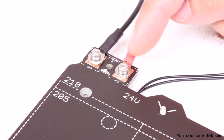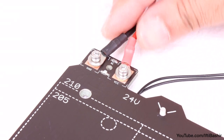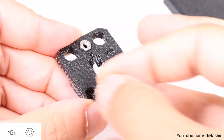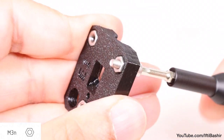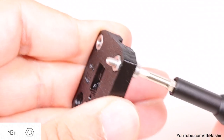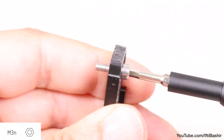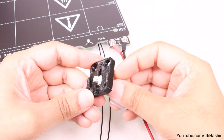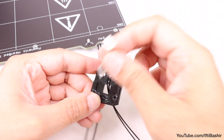The cable cover, which we'll install next, needs the connectors to be slightly inclined towards each other. On to the cable cover next, where we insert three M3 nuts into the shaped openings. I found these very tight, so get them into position and use the screw pulling technique if needed to ensure the nuts are right inside the recesses in the printed part. Before pushing the heat bed thermistor cable that was pre-installed on the heat bed through the bottom of the cable cover.